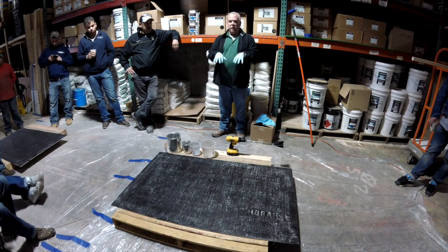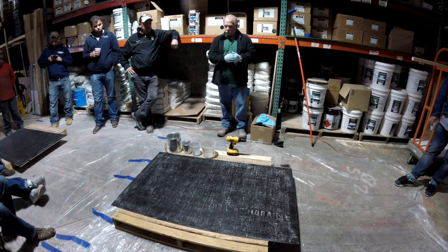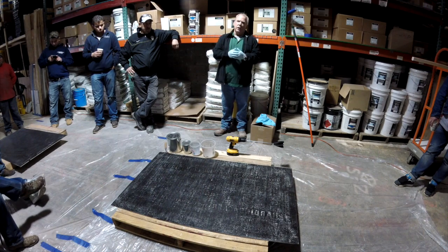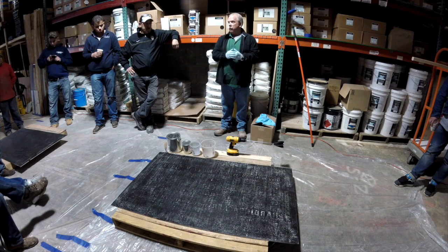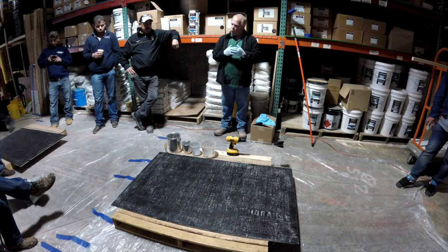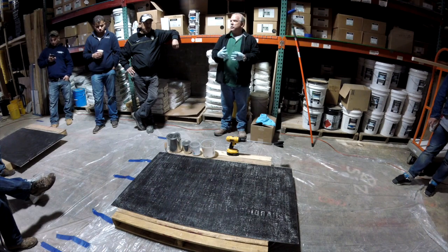The other thing that we're doing here on this particular one, we're using a water-based epoxy here. Now the water-based epoxy itself will handle almost 13, up to a number 13 in the PSI range. So the water-based epoxy does a lot. And since it is water-based, when it first goes out, if there's any moisture in that slab, that water actually helps that epoxy to bond. Okay? Very, very strong epoxy. It's less money, so it's more economical for you to be able to put this epoxy out.